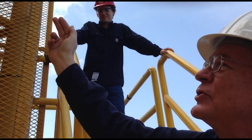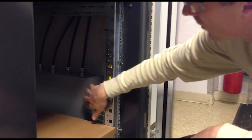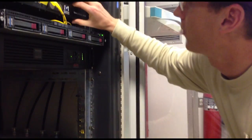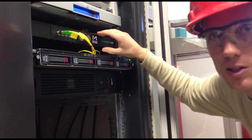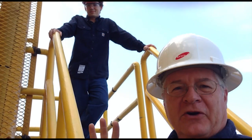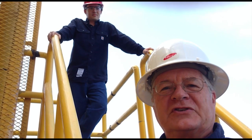From there it runs into the control room. The fibers come in through these cables, then through this junction box, and up to the fiber optic sensing module. This is the sensing module that sends the lasers down the fiber optics, down to the sensors, and then back up. From there we gather data, analyze the data, and determine what the loads are on these tendons.